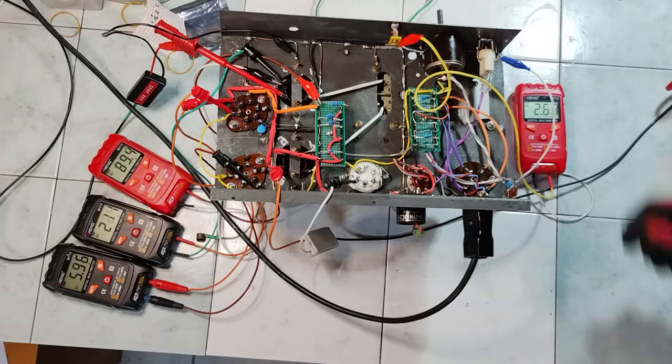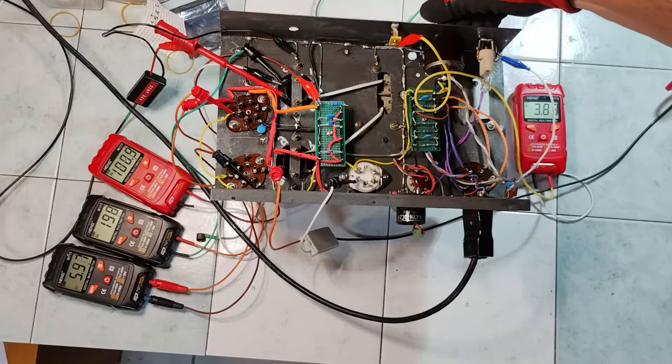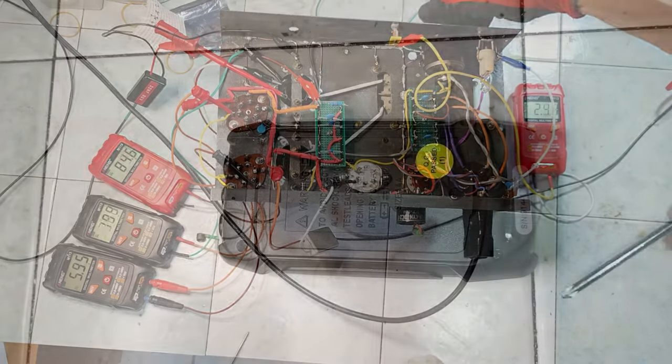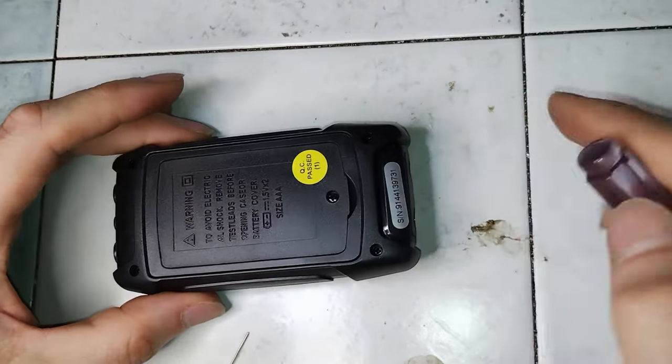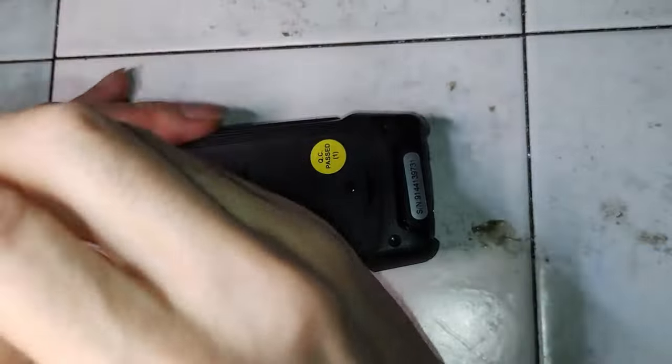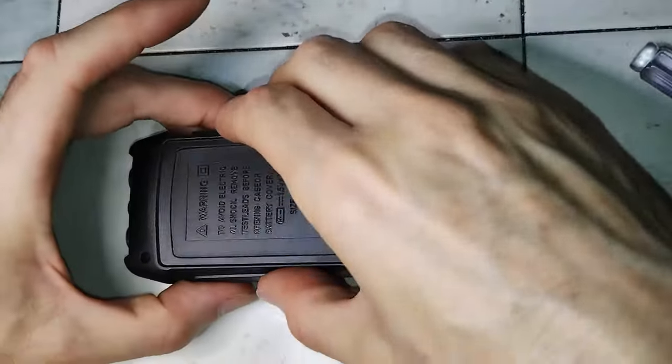When using more than a couple of voltmeters on a circuit containing high voltages, the usual test leads could be difficult and even dangerous to manage. Also, the excessive length of the lead wires could become an issue for safety concerns. To make things easier, some cheap auto multimeters have been adapted with fixed short leads using either small hook or alligator clips.